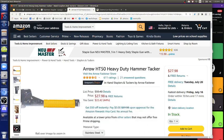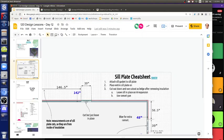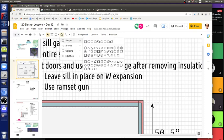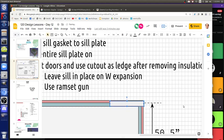onto the foundation. The only detail you have to pay attention to is the corner. The corner's right there, and there's a logic to the corner. Look at the corner, what's happening there? Remember how the panels are going the long way, that the 4x4 foot panel lays here like this. It goes all the way to the edge, but the sill plate does not. Why? Because the panel is then used to bind the two together. So if you screw into right there and right there, you've bound these two sill plates together. Does that make sense?